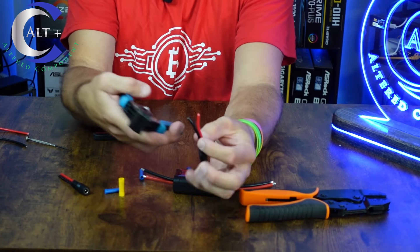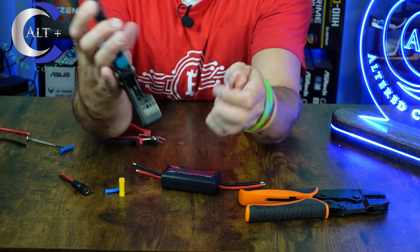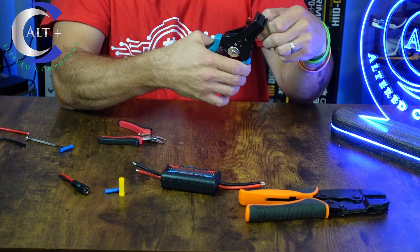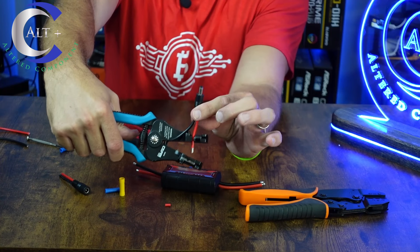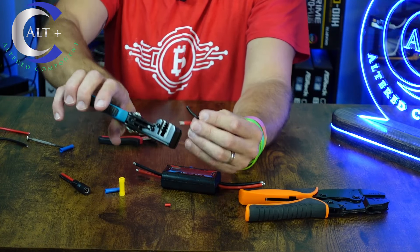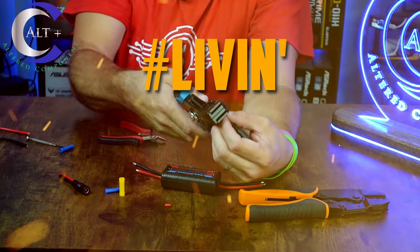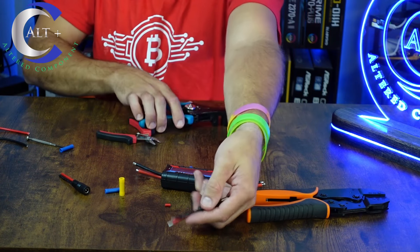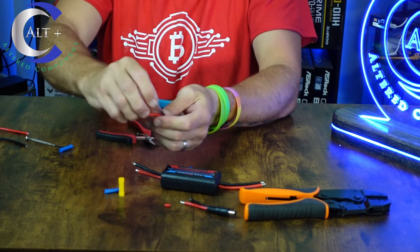Let's show you how the wire stripper works. On the side it has 16, 14, 12, and 10 circles. You just put the wire through — it grabs it, pulls it, and strips it all in one fell swoop. I'm putting this into the 12 slot with just a little bit exposed, and when I squeeze it, it grabs and pops the casing right off. That is how it goes — that is the way to live. The old method of spinning around and around trying to get it off? That's for cavemen. There's the black one and there's the red. I give it a little twist to make sure the wire is nice and neat.